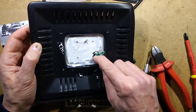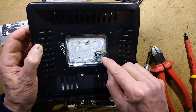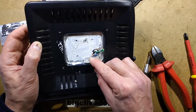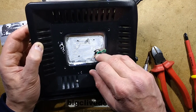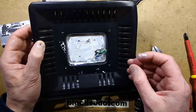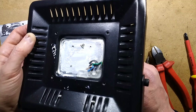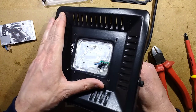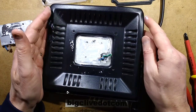I don't like that at all. You can see the cable has been deformed there, and it almost makes me wonder — I hope it's not plastic just masquerading as rubber. If that were plastic, there's a risk the heat could actually melt through it until it shorts out against the LED plate. There's no cable relief other than the earth wire, and that was too easy to release. That's where water's going to get in — that's not impressive.